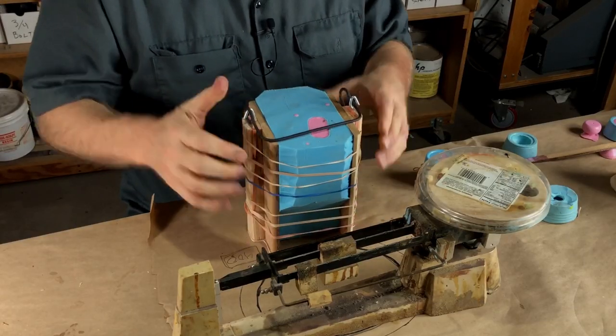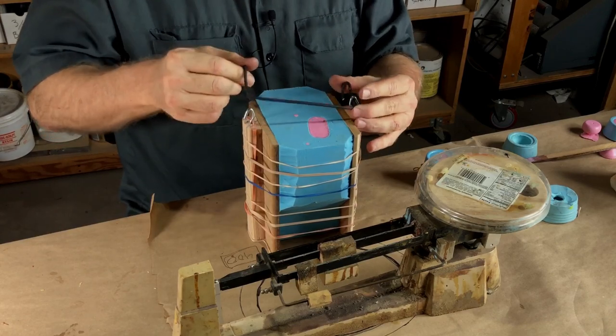Back from the tanks. What you did not see, because it was off camera, was we had our first debacle of this project, and that is that my tanks are 30 years old. They've always worked flawlessly, no problem, but my vertical tank failed me. It was because the adhesive dried up around the gasket. And of course, I haven't checked it. Not one of these tanks has ever had its gasket adhesive replaced. They all seem to work, so it didn't occur to me to check it. But it wouldn't hold air.